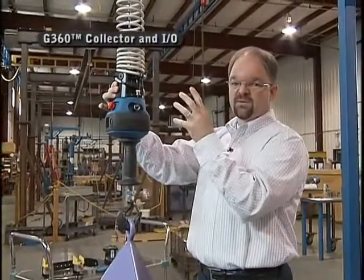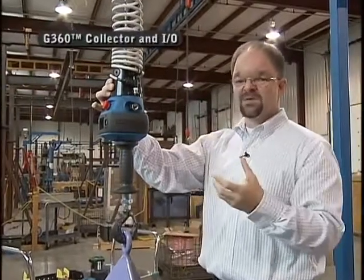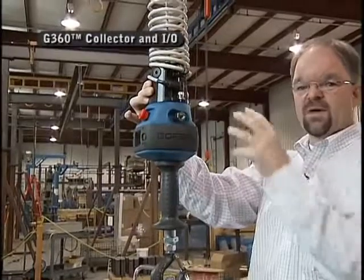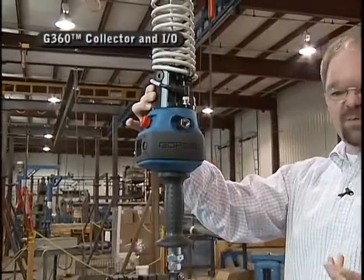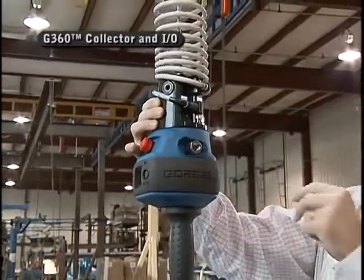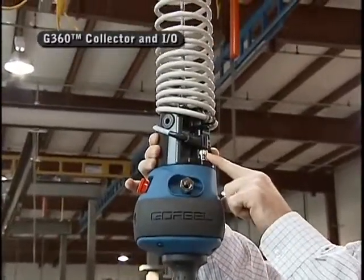And the Q and IQ unit both have a CAN bus interface, which is a simple two-wire data stream that will run back in here, which allows you to put quite a bit of input and output on the tool itself and carry it back through the swivel point on a 2-wire feed. That connection point will be right here.